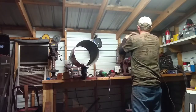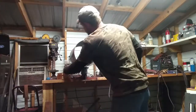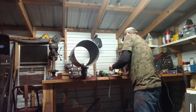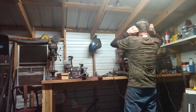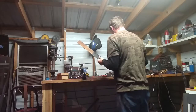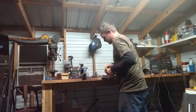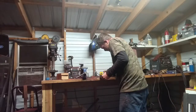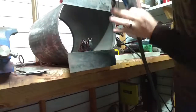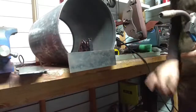Got it cleaned up. What I want to do is take my tape measure and mark this piece. We're going to cut these pieces 10 inches and get them ready to weld to the front of our body. That's going to go up here, then our angle is going to go on top of this on the weld — that's going to be our track for our brick. I got this set at two and a quarter depth, got it running level. I'm going to go ahead and tack this in place.